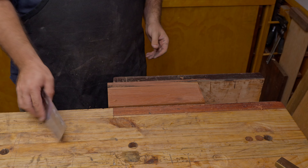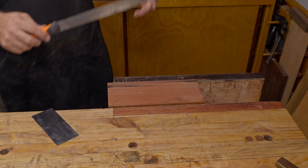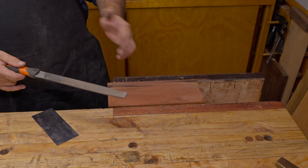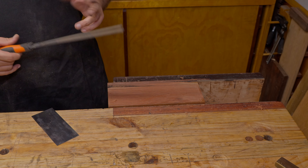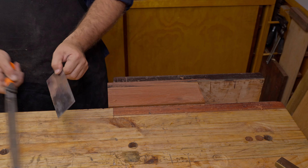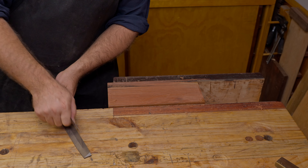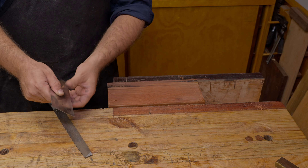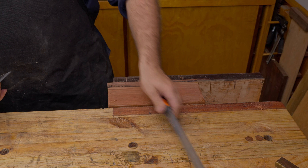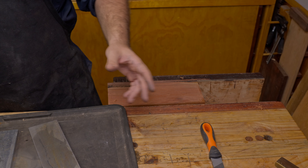This first process you can do using two tools. You can use a mill file — which kind of works — but I don't think that's as good as using a 400 grit diamond stone. If you were going to use the file, you get whichever side you want your rough burr on and you can just run it back and forwards like this on your file, then feel until you've got a burr or a hook there, and it's that simple. But I find you get a better, quicker result using something like a 400 grit diamond stone.